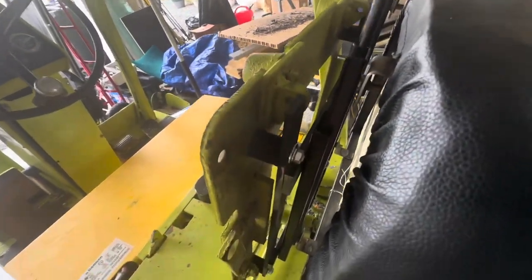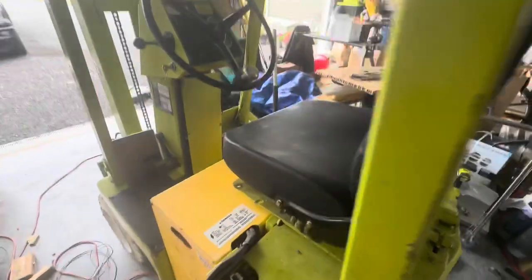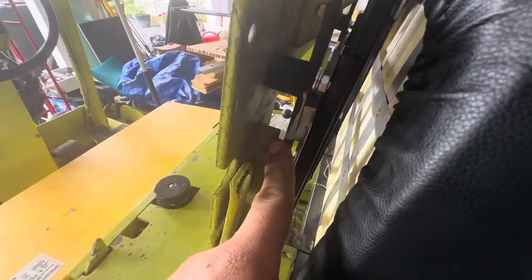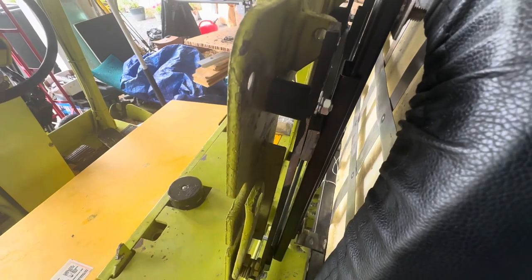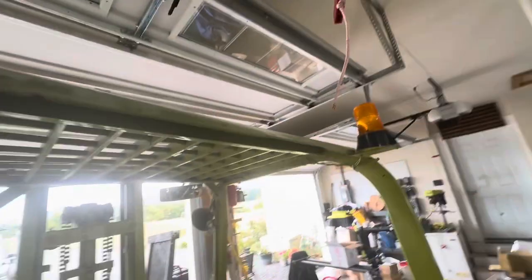The new printed spacers are in, everything works great, and the seat now has forward and backward adjustment capability — I'm not stuck in one spot anymore. The biggest downfall is that it sits me a little bit taller than before, and I'm a tall guy so I kind of hit my head. I may go back and flip the seat bracket over so the mounting piece is underneath, which would lower the seat by about a quarter to half an inch. It's really nice that you can go into Bambu Studio and work in a slicer to make a simple functional part without having to open Fusion 360.